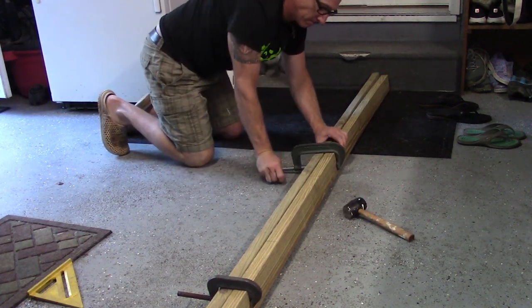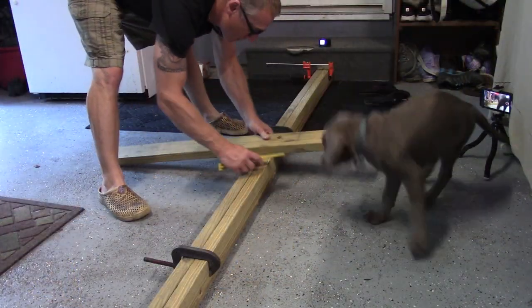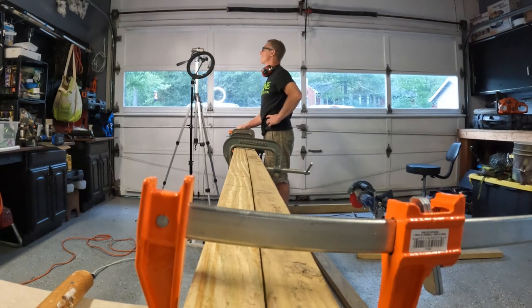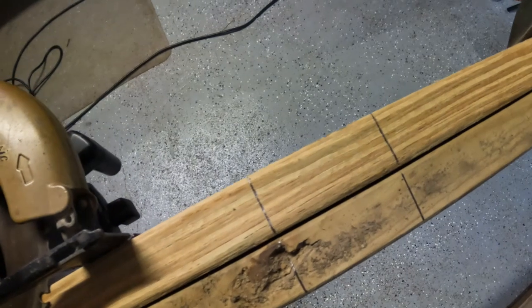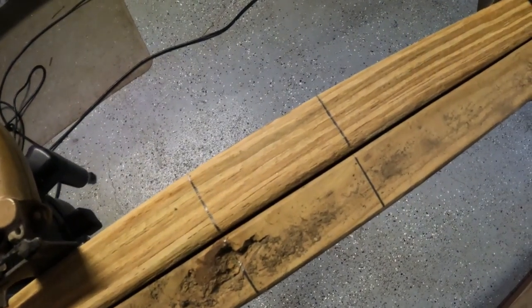I get two boards at 12 feet 4 inches — one straight, the other not so much. I went ahead and measured the straight board, then used some clamps to clamp them together to straighten the other board out and mark both. Now that the two by four legs are clamped together and marked off 18 inches apart for where the rungs are going to go, I'm going to take my circular saw and score the top and bottom lines, then continue cutting all the way through the two by four inset area. I set the blade depth to an inch and a half — the actual height of a two by four — so I'll have an inset that's an inch and a half deep, into which each rung will fit right into the legs on both sides.